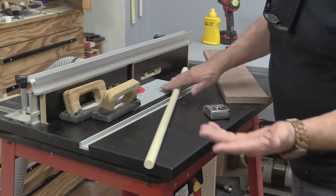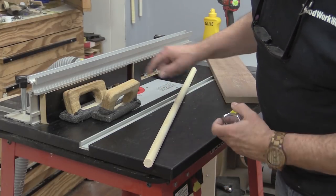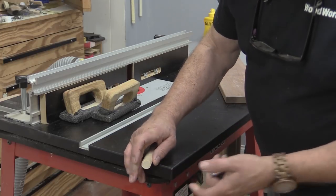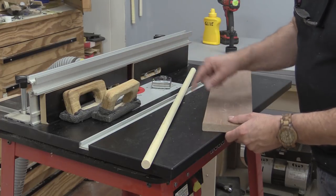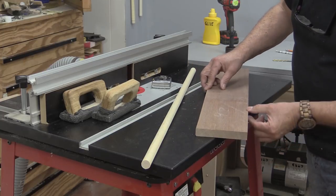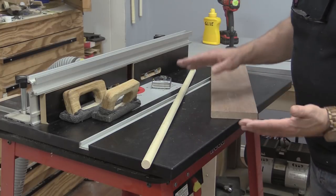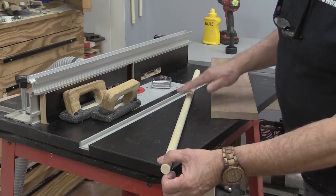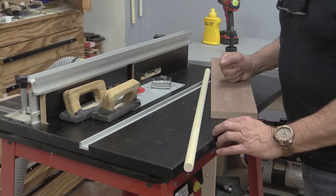There's my dowel, and I can make this as long as I want. Because it was a three-quarter inch round-over bit, it gives me a three-quarter inch piece of dowel, and I could make multiples of these. I could use this side, run it through, get the half-round on this side and the same on the other, cut those off on the table saw, come back and redo it. You could make lots and lots of doweling in any size and any length you want — just that easy by starting with larger pieces of wood.